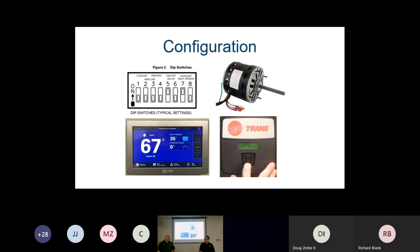The way you charge the unit is going to then affect something down the road, and next season you'll get a phone call, or if it's a heat pump, come fall season, all of a sudden this unit's tripping out on high pressure. Well, how did that happen? You and I, as FSRs, start with that service tech going back and saying, okay, what air handler do you have? Oh, that's the one with that particular motor. Let's go in and check those dip switches, those wiring connections. Let's go back and make sure that it was set up right. And normally we find that if the airflow wasn't right, we just snowball in a bunch of other mistakes.